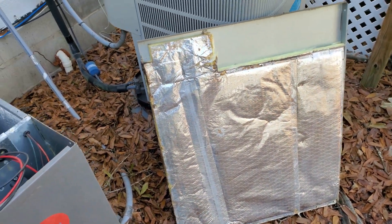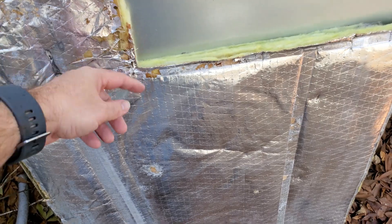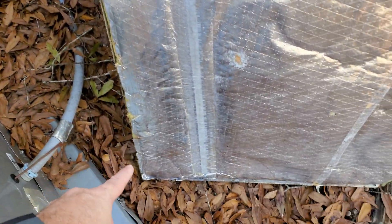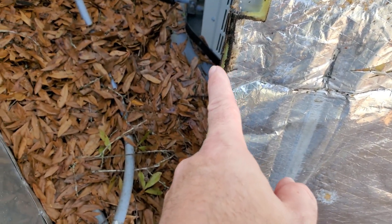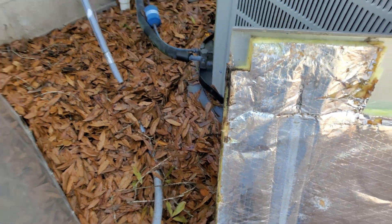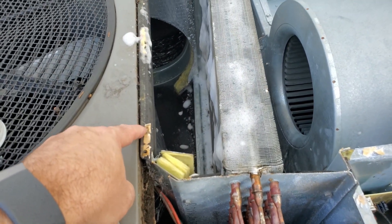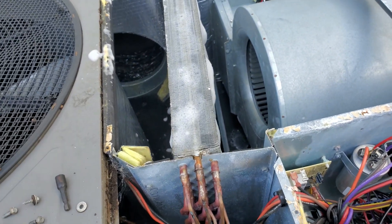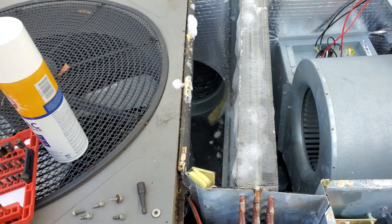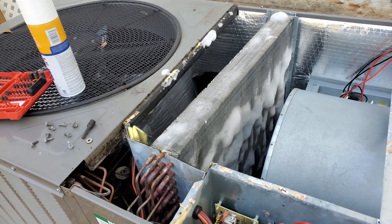This was the first time I had to remove this since the unit is less than two years old. There was sort of a seal here so I had to slowly pry it all open. I discovered this area was a little wet, which is a little concerning — and maybe where I was getting that musty smell from. It's also right here on this channel, and as you can see there's a gasket here. I'm going to clean this out before I seal it back up, and hopefully this will fix the musty odor smell that I got when my unit kicked on the other day.